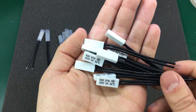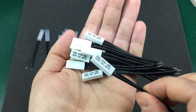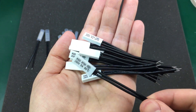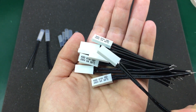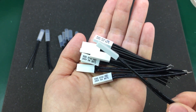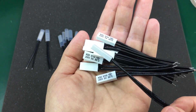Next, I have a set of 10 pieces, this time with plastic package, so you don't have to worry about shorting anything in your circuit with these. They have the same specs as the previous ones except for the outer plastic package, and I got these rated for 50 degrees Celsius. They are normally closed, so you would rather use these for opening a circuit, thus offering protection in case of overheat.